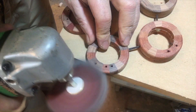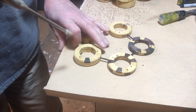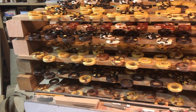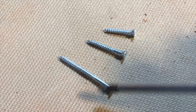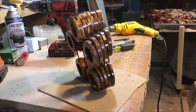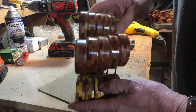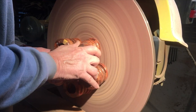The areas where the dowels are need to be manually rounded off — I can't get the router bit there. A little cleanup with a sanding mop gets them all ready to spray their first coat of finish. After a little cleanup with compressed air, I'll start the finishing process: many coats of gloss lacquer, buffed between coats. I used a variety of number four screws in various lengths from three-quarter to inch-and-a-half, and this is kind of a step-at-a-time process — screwing these things together, checking for nice tight fits, and occasionally touching them on the disc sander to keep them nice and flat.